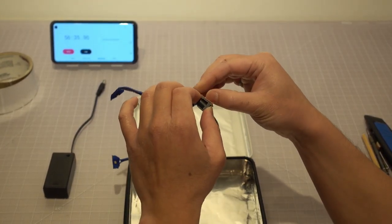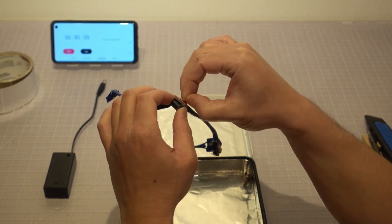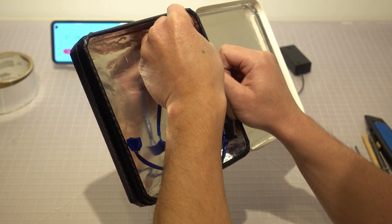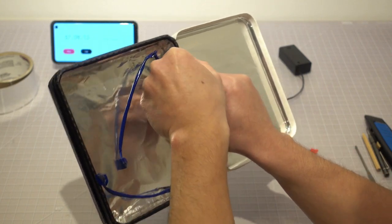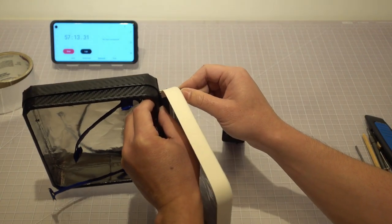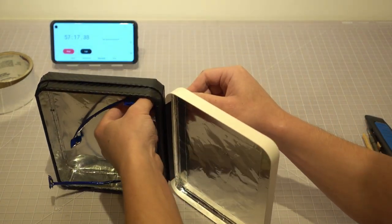Peel off the remaining vinyl cover on the bottom side of the jack and stick it to the bottom of the box adjacent to the hole you just made. Try to insert the power plug into the jack to see if everything fits. Make adjustment if not.